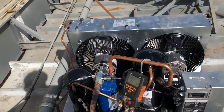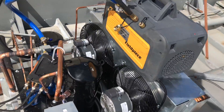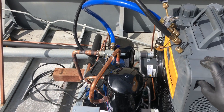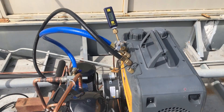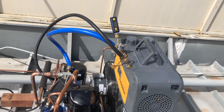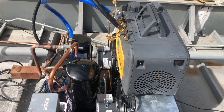We're gonna get ready for the micron gauge. We'll pull a vacuum on this. The micron gauge is hooked up to the low side by the accumulator. I got my three-eighths by quarter hooked up on the receiver. I'm gonna get a reading on microns off the tee of the vacuum pump because I got nowhere else to put it. I got nice service valves over here so I want to use those. It passed its pressure test. I got the TXV changed out. That's where the line set went over there - I picked up one connector right there and came up into the unit.